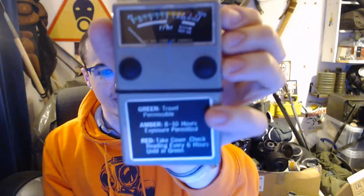I'll do a proper video on it at some point, but I was really pleased to get it working. It wasn't all that hard — I just put it on my bench transformer to dial it up to the right voltage and check it was running properly, then bodged batteries into it. The range is 0.02 milli-roentgen up to 200 roentgen per hour — a very nice range. It starts lower than, say, a CDV-715, but it covers a really practical range, not quite as sensitive as a lot of Geiger counters but goes up to quite a high level.